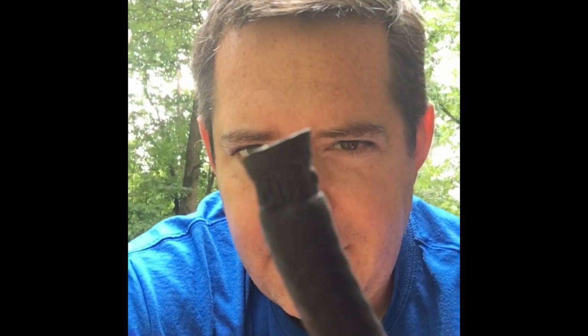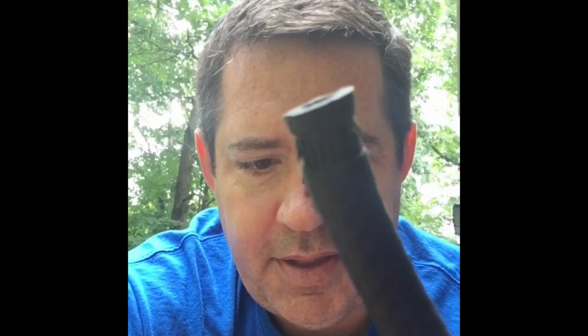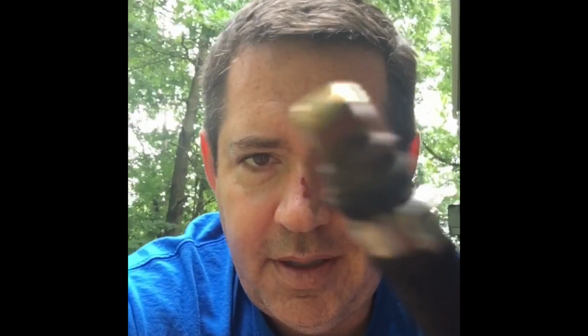So I don't know if you can see this, but the original is kind of damaged because it had a worm drive clamp on it. Most of the fuel lines are connected with worm drive, and according to Onan, you should not be using that. You should be using this crimp kind, this is the only one that was actually on any of my fuel lines.